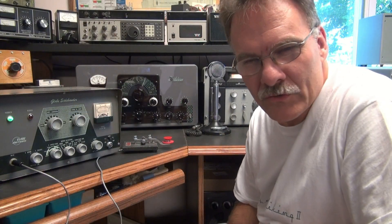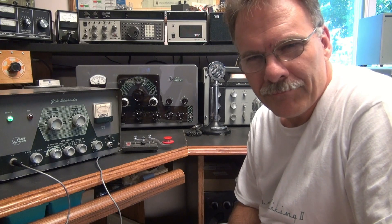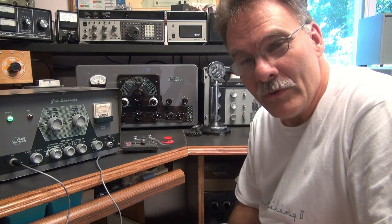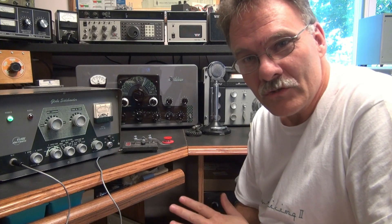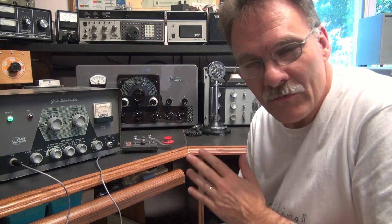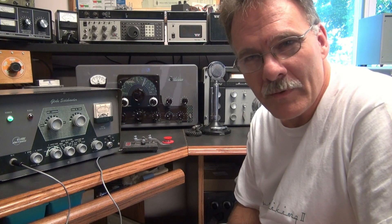Let me give you a little bit of history about this DSB100. When I picked it up, it was in good cosmetic shape, but electrically it didn't work. Had to go through it, changed a lot of resistors, filter caps, changed the tubes, gave it a tune-up, controls cleaned, cleaned the face, waxed it, all that good stuff. And now it seems to be working really well.